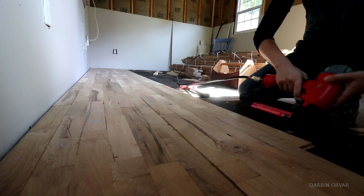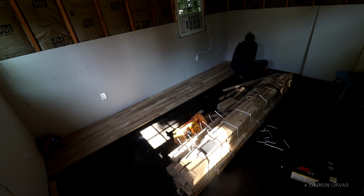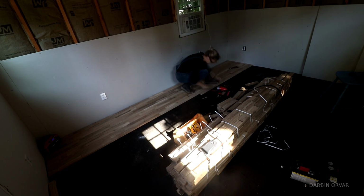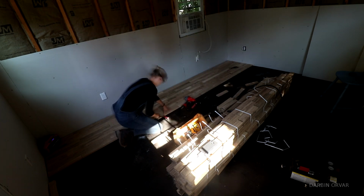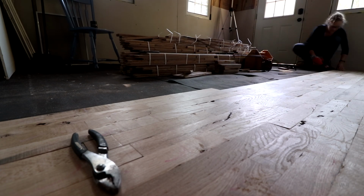Perhaps they would show you some engineered hardwoods and other rather glossy and polished options, which I would not recommend in a shop, because add some sawdust to that finish and then you have a very slippery surface. Plus, any dents are going to chip and not look so great. So solid wood is definitely the way to go if you have that option.